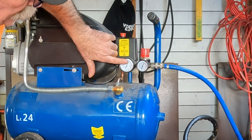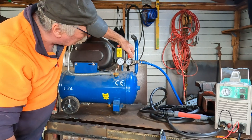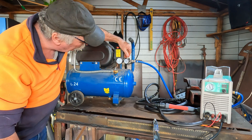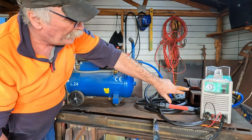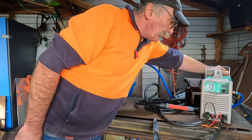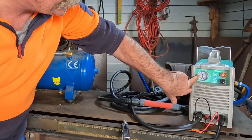I've got this set at about 110 PSI on the gauge here, and we're putting out about 100 PSI there. So if we back this down to about 60, then we should be about right. We want about 60 PSI. About there looks good to me — so we've got about 60 here, we've got the tank set at about 105, and we're running about 60 here as well. Let's kick the S-Welder plasma cutter on and see what happens. We've got this fired up now, we are going to be cutting on 2T mode, and I'm going to cut at 55 amps. Like I say, we're at about 60 PSI here.